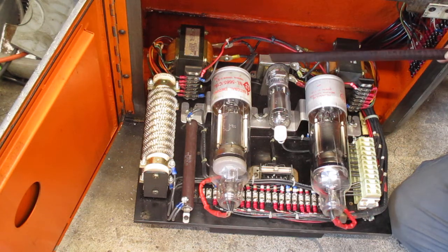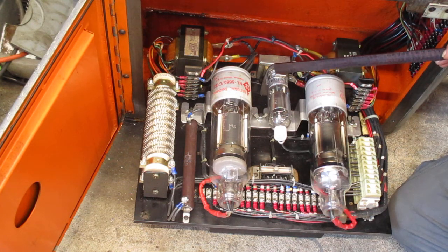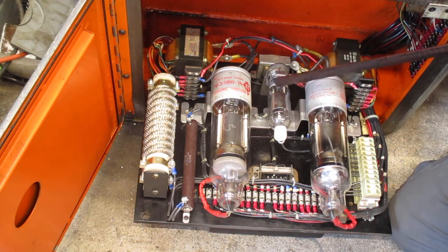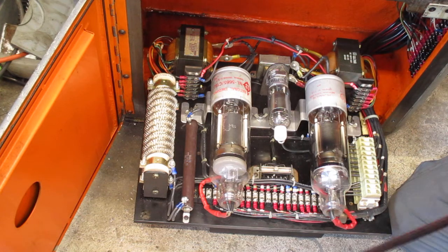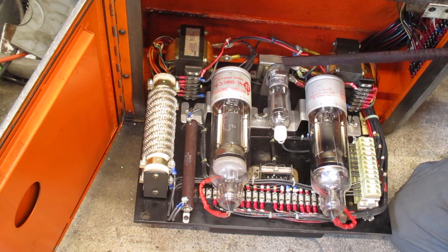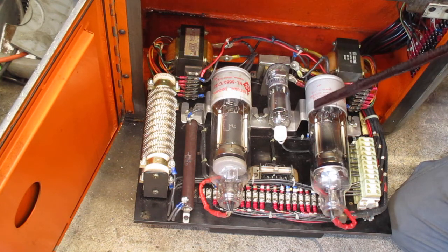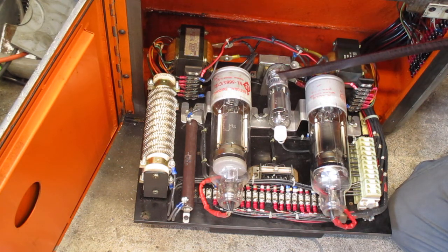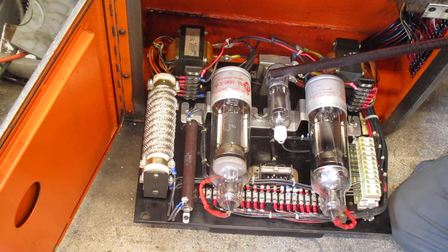Here's the trouble component — this is the field tube, a small thyratron tube. You can usually get them for around a hundred dollars, and they last a long time, but they do wear out. There's a lot of stress on this tube because it powers the module and the relay switches in the electrical panel. It's a hard-working tube, and it can fool you — it may work for a while, then as the machine heats up it'll act up or work intermittently.